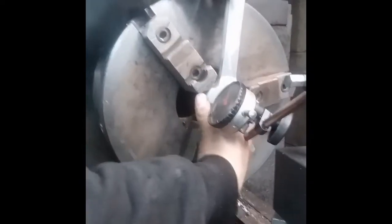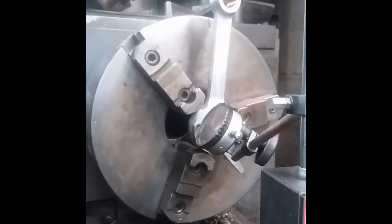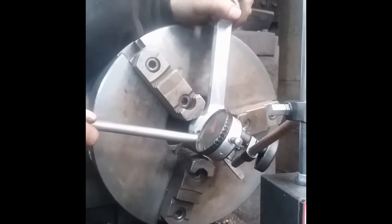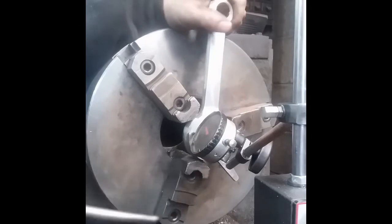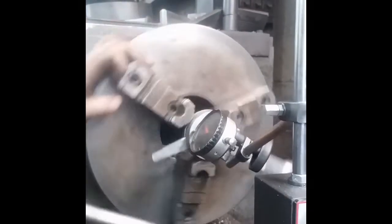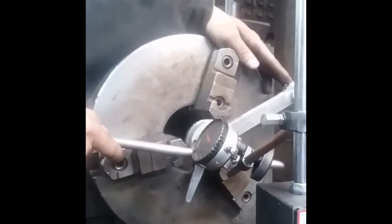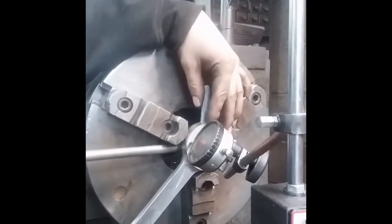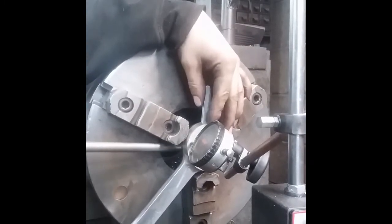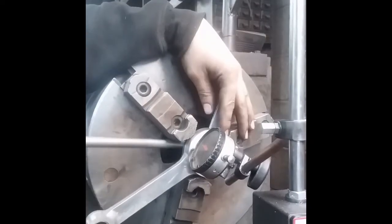The rod that came out was from 1958. Okay. And it's 850 thousandths thick. These are 855, 856. When I put the end cap on to tighten everything back up, you can't turn it. So we just have to take 12, 13. I'm going to go for 13 thousandths. Okay. Narrow it up. But a compressor, just like you have upstairs, for a rebuild.